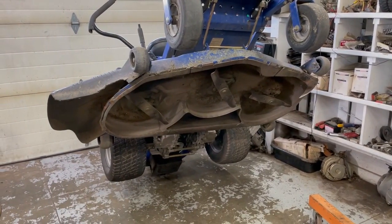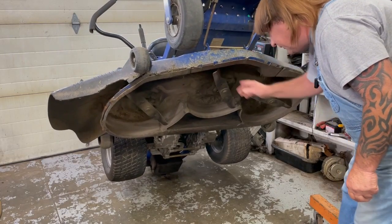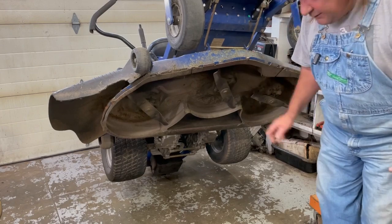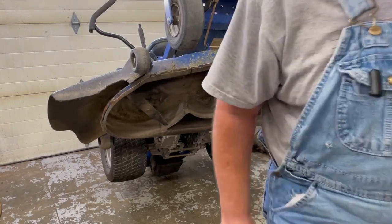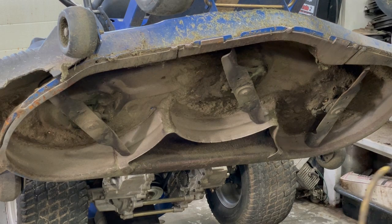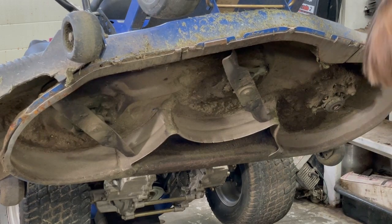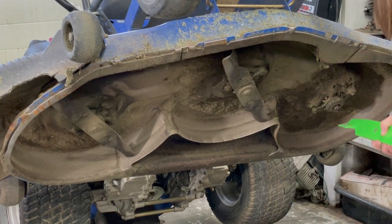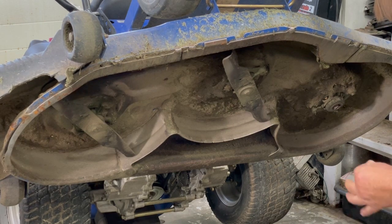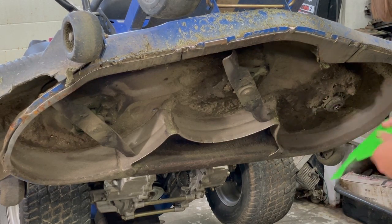I can see why it's not cutting right — a couple of the blades are bent and there's absolutely no sharp edge on them. So we'll go ahead and pop them off and put some new blades on there. On these here it's a 5/8 bolt, and they got these stars on them, so make sure they fit on them stars on them hubs, and make sure these lifts are up in the deck. You don't want to put it in upside down.